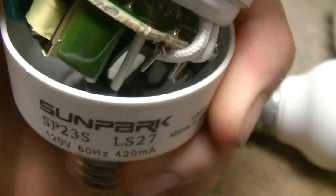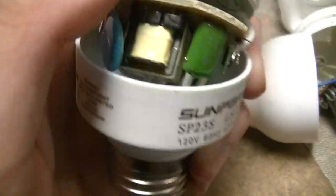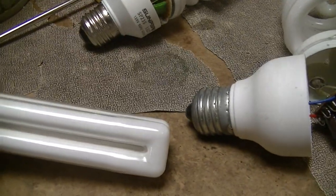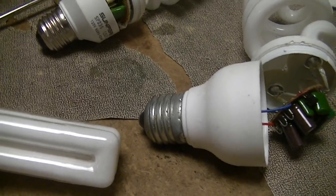As you can see, it's got a thermal fuse or a fusible resistor — it's kind of hard to see in there, but there's a component in black heat shrink right next to the electrolytic. You can kind of see the end of it next to those two fiberglass sleeves, which are just insulation to keep the leads on the electrolytic from shorting out — because obviously that would short out the DC bus in the thing, which would be bad, lots of smoke. And those fusible resistors are generally not quite as good as proper fuses.